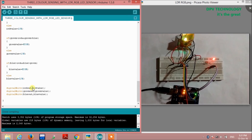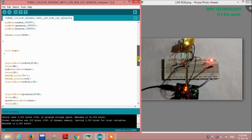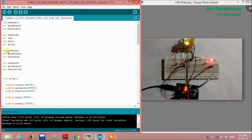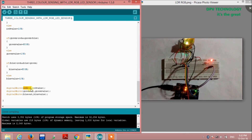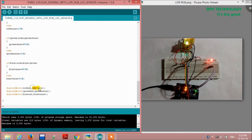So we write digital write red out, red value. Since red value is HIGH for a red object, red out becomes HIGH and the output LED turns red. Red out is the integer for pin 8, and the red terminal of the output LED is connected to pin 8. Since green value and blue value are LOW, the LED will only become red and will not blink with any other color.